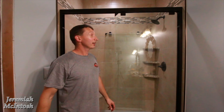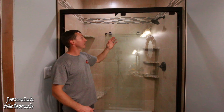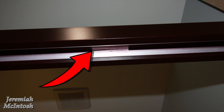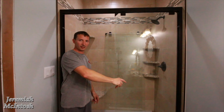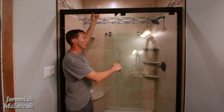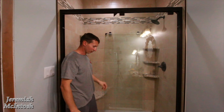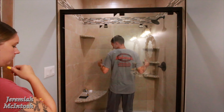I've got one panel already installed. You have to put both panels inside the shower first, then put the outside one in first, then the inside one. There's a little notch in the top rail to put the rollers in first, but you have to lift the track up off the side rails for the bottom frame to go into the slide. The second panel will be harder because we'll have to lift it with the other glass already in there — these panels are super heavy.